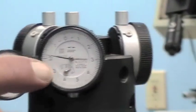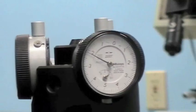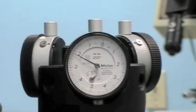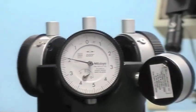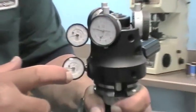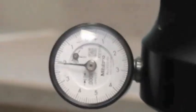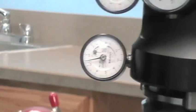If you notice, the gauges that used to be on zero have now moved quite a bit. What's happening is the bulge that the retention knob creates on the holder keeps it from going into your spindle. As you see, all the gauges are reading pretty much the same. But the really interesting ones are the two little dials pointing into the taper — that bottom one represents what happens in your machine as it's spinning and cutting, moving back and forth.